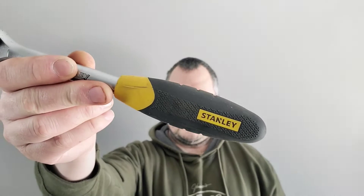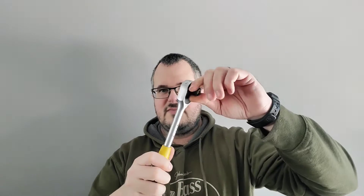Hey and welcome back to my channel. Today I'm going to be fixing up this Stanley ratchet that I picked up with a bunch of other tools somebody was getting rid of. This ratchet doesn't turn — it's really stiff. These things are easily taken apart and cleaned up. A lot of times water and dirt get in and prevent them from functioning properly. It's a quick and easy fix that could save you a lot of money.